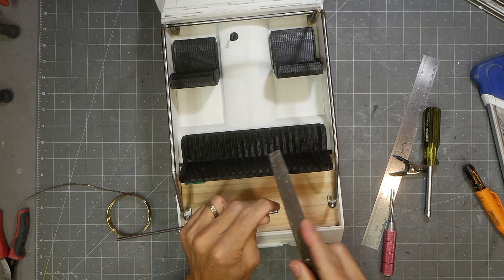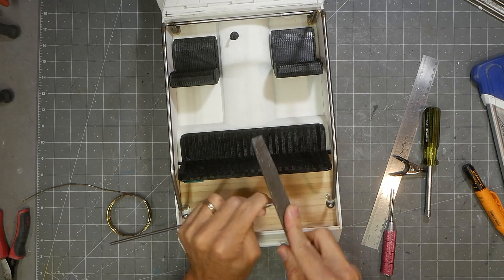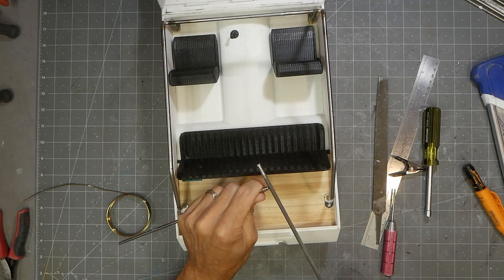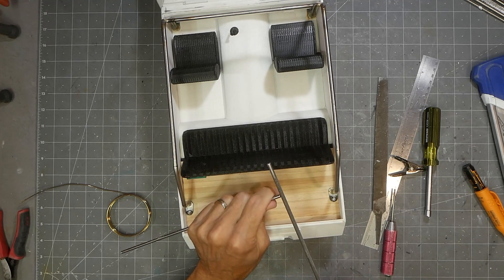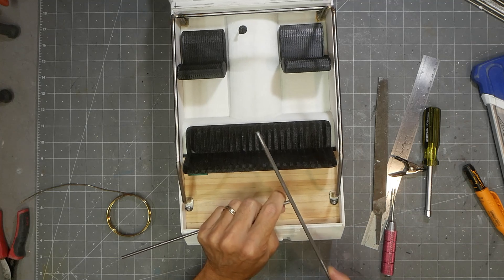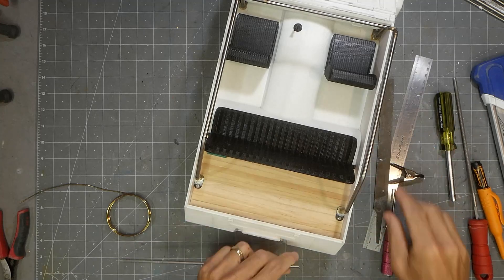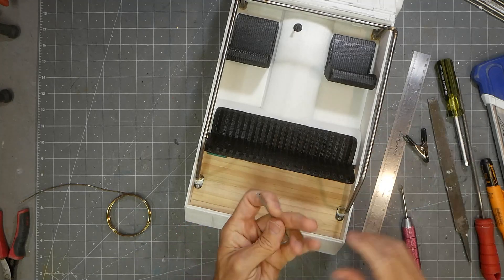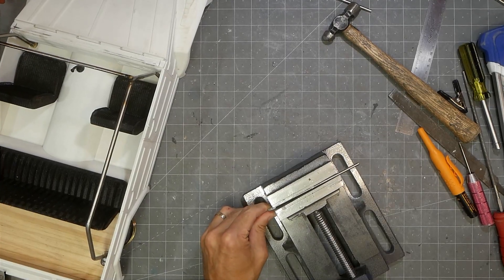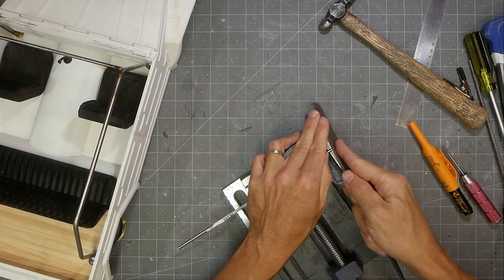It's a little hard to see in a vise, and not everybody has one, so I wanted to show you can do this by hand. Just take your time, put a little notch in it with your file, and once you get it started you can go to town and get that shape. It doesn't have to be a straight 90-degree shape either — you can do 30, 60, whatever angle you need — because the most important part with soldering is having good metal-to-metal contact.